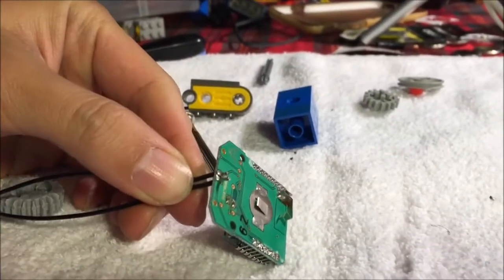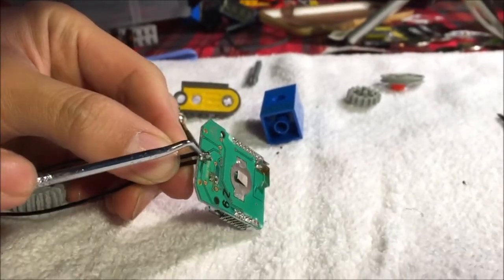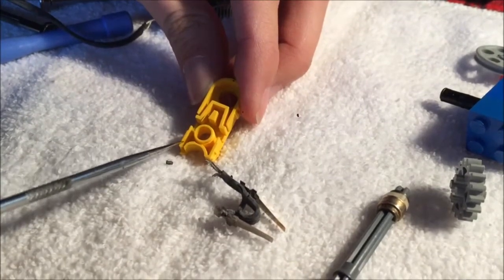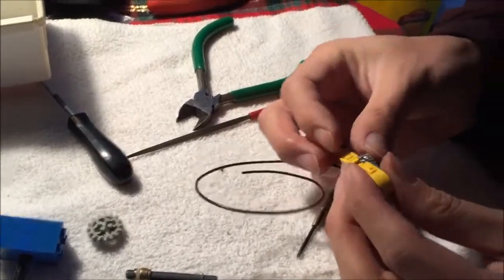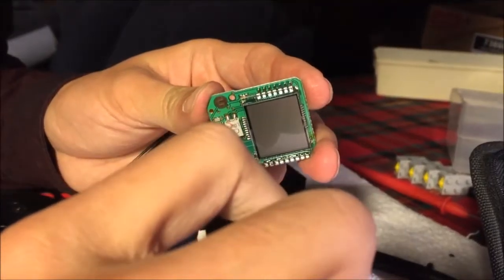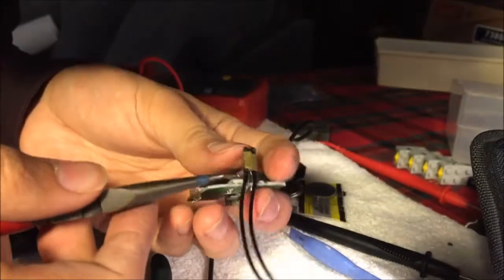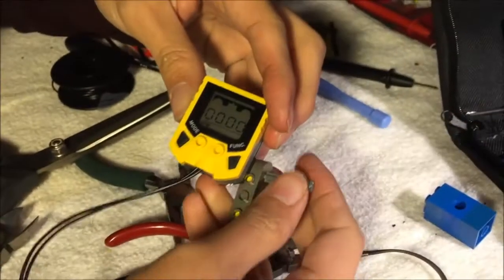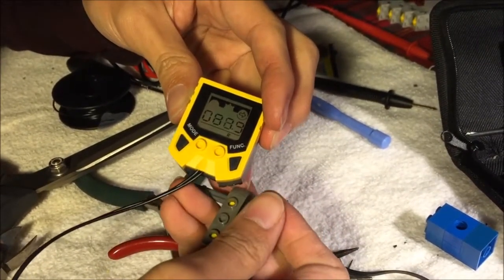We double-checked that no stray solder joined the wires on the PCB side, since the holes are very close together. Prior to soldering, we looped the wires on the sensor side around the stress relief pattern such that everything pressed together easily upon reassembly. We replicated the stress relief crimp on the PCB side with a tiny rectangle of brass sheet, as we could not remove the old crimp from the old wire. We temporarily taped the shell back together in case anything went wrong, but it powered right back up, and now we can look at the functions in detail.